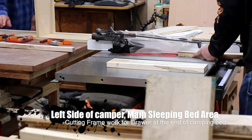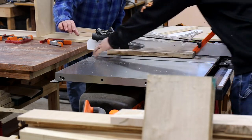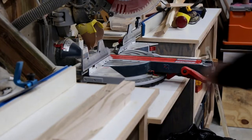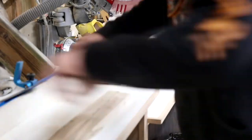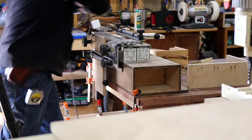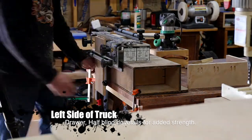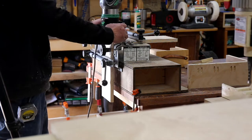Now for some quick tips on cutting out the holes so they look like they're done at the factory. As we're working on the right-hand side, we're going to use the jigsaw to cut the rough opening, then build a temporary frame out of scrap plywood from the cutdowns. We'll use double-sided tape to smash it down to the actual plywood, then use a flush trim bit to route it out really smooth. You're going to have a radius corner that comes from the size of the trim bit, so when the build out is done the holes are machined nicely — it looks like a CNC machine, but it's all done handheld using a router template.